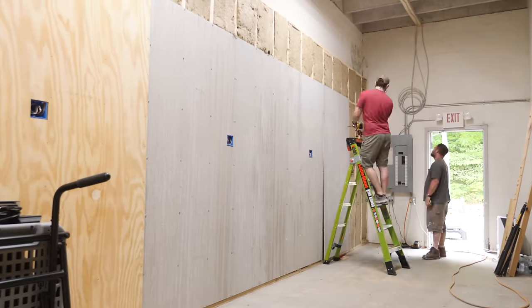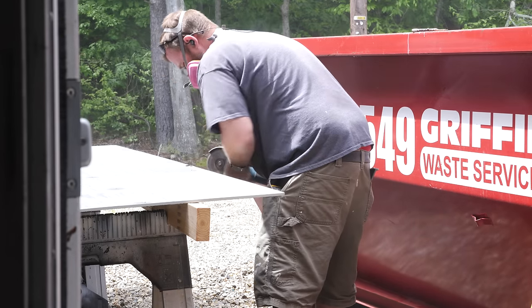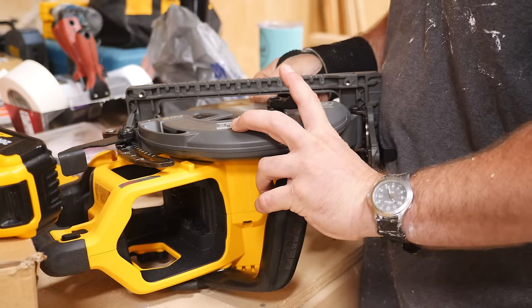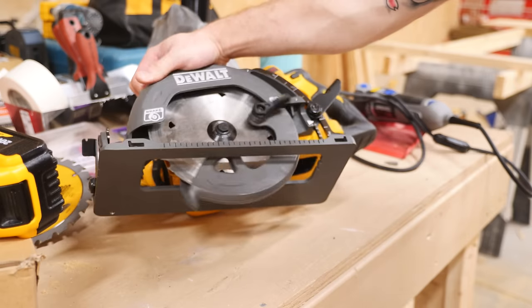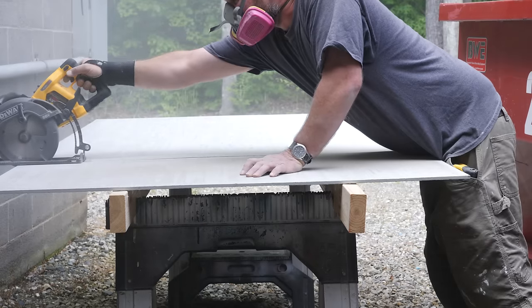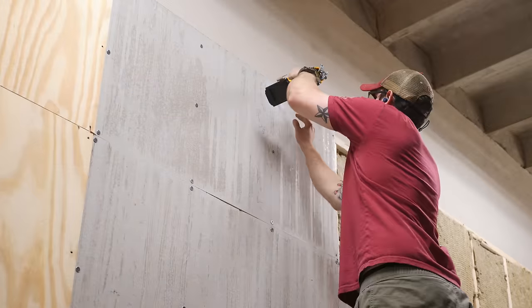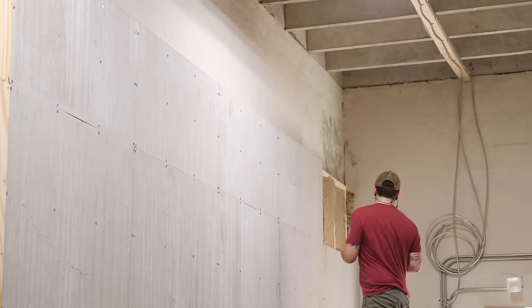To cut around any electrical boxes, we used an angle grinder with a diamond cutting wheel, which made really quick work of the process. Hanging the panels was just like the rest of the wall coverings, and having the holes pre-drilled made the process go extremely quickly. We continued on down the wall, with me driving screws while Justin cut around any obstructions. We ended up with a full sheet at the end of the wall, which was just a happy accident. For the top row, we swapped out the standard circular saw blade for a blade designed for cutting fiber cement, which has very few teeth compared to a regular wood cutting blade. Cutting the panels was incredibly messy but went quickly, and with the last row mounted, we could call this part of the project complete.